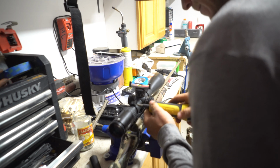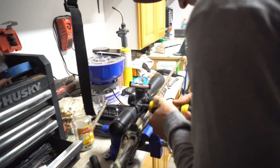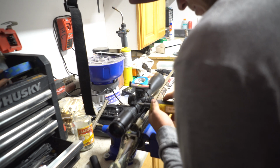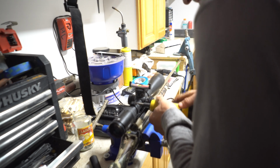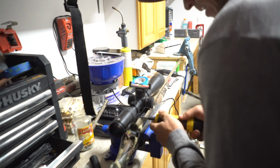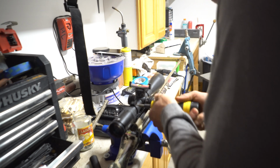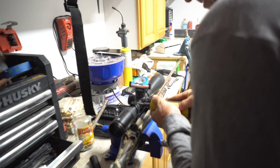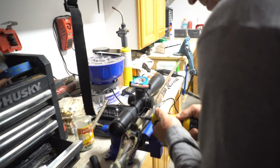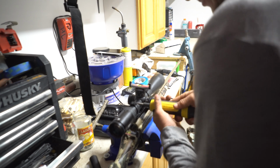Torqued over. Torqued over. Torqued over. Torqued over. And go back through and check them all. See, we got a little bit out of that one. You want to go through and check every single one of these until they all snap at 35 inch-pounds.